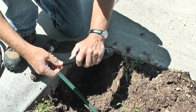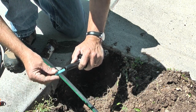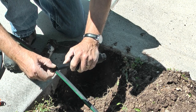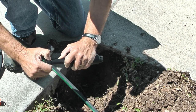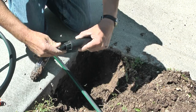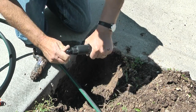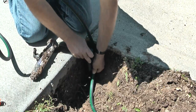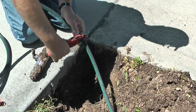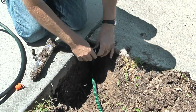With one end of the funny pipe attached to the barb elbow on the sprinkler line, next I'll install a Rain Bird 15-VAN nozzle and screen into the shaft of the sprinkler body. VAN stands for Variable Arc Nozzle. Then I'll thread a new barb elbow into the bottom of the sprinkler head. Once that's done I'll position the head into the corner and measure where I need to cut the funny pipe. After I make the cut I'll shove the end of the funny pipe onto the barb elbow.